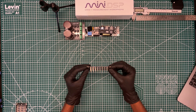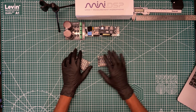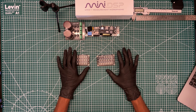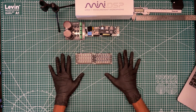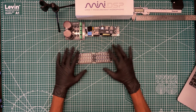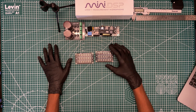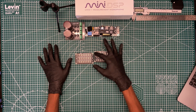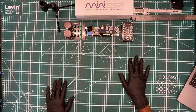Look at those copper terminals and the really thick PCB — this can handle a crazy amount of power. A power link board is basically a jumper to parallel connections, to make wiring easy. If you have to service tomorrow, you can just unplug one amplifier without rummaging through multiple amplifiers. This makes life easier and wiring cleaner. It's more or less branded — everything is planned and it will only work with their amplifier. We use 30-0-30 input here, and it provides one input with all outputs in parallel: AC, ground, AC — all in parallel.